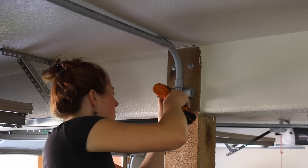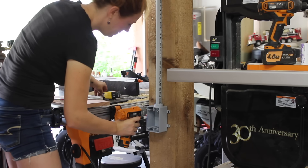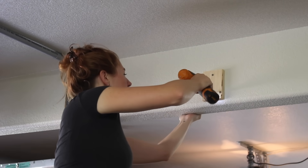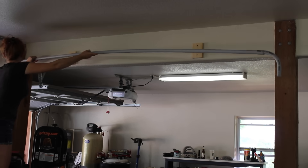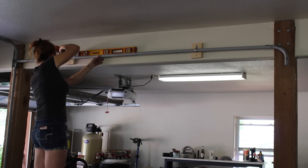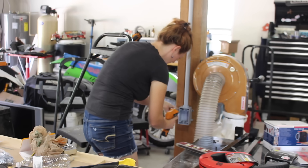I secured the junction box, then continued running PVC straight down to the first gang box. After getting that attached, I cut some scraps to make standoffs, since the center posts I was running conduit on are on a slightly different plane than the beam running in between. Doing it this way ensures the conduit stays on the same plane from post to post without bending in the center. After reaching the second post, I did a sweep 90 down to the second gang box.